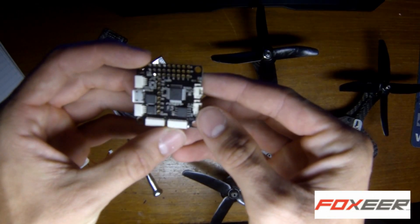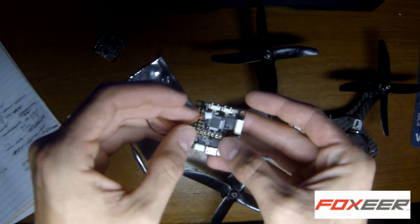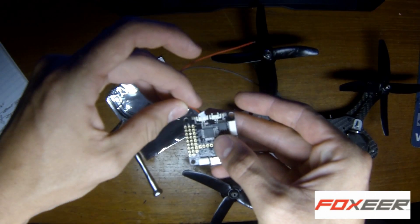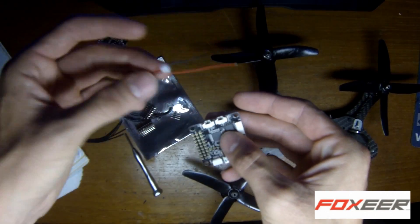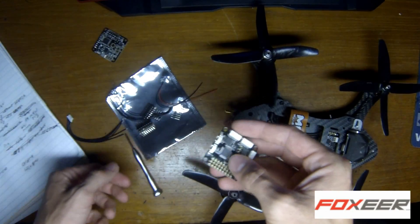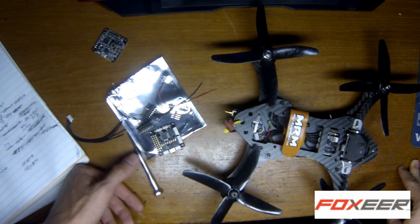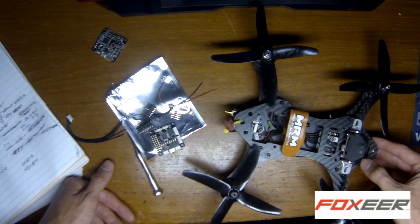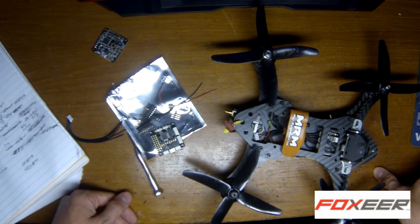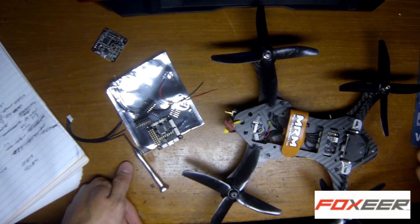They also include one plug for both the battery and the buzzer, so if you need another one you'll need to source the plugs or borrow one. I didn't use the battery hookup because my OSD wasn't functioning right. It does run Raceflight very, very well — I'm on a 4kHz refresh cycle and it's barely pulling 3% of processor power.